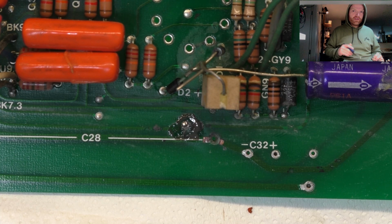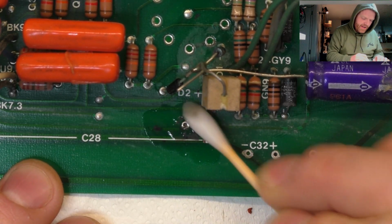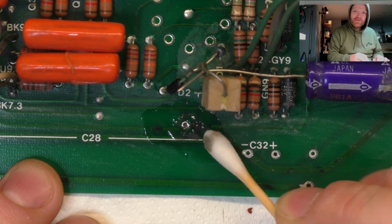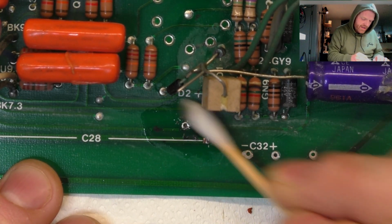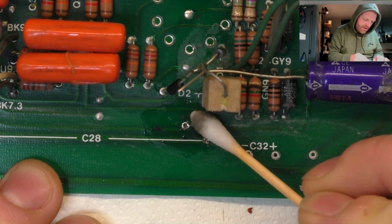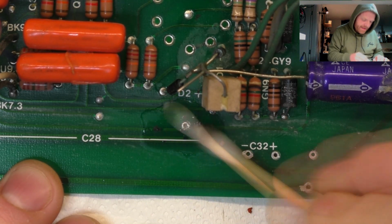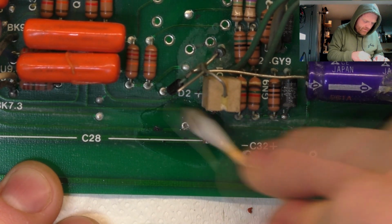You either replace the socket or you clean it manually with alcohol and a toothpick if it's not too far gone. You spray anything on the board and all bets are off. You may have just destroyed your amp. And that grey stuff, it sort of bonds with the flux and goes hard as a rock. Normally that flux would be cleared by now with alcohol, but whatever it is, it turns to rock when you heat it.